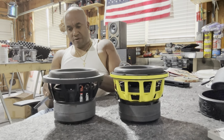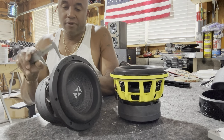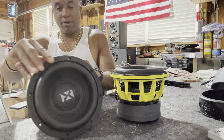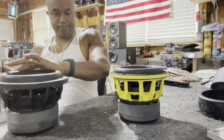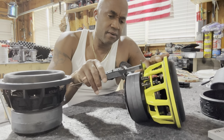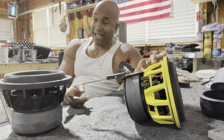Now look at the motor structures. Let's see where this is at — see how much we're losing and what we're gaining here. The total magnetic structure of this woofer is 73 millimeters, with the slugs themselves coming in at 51 millimeters. So 73 and 51 — 500 to 600 watts RMS. Whereas here, the total magnetic structure is 68 millimeters and the slugs themselves are 45 millimeters. That's 6 more millimeters of magnet on the budget woofer.